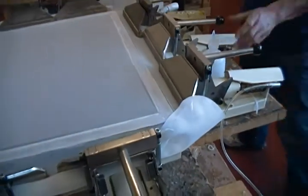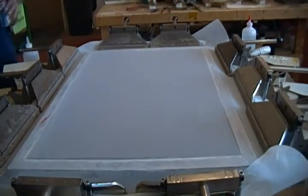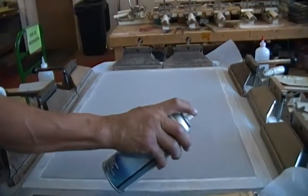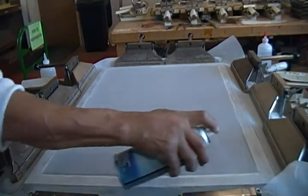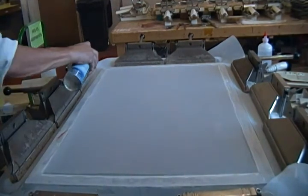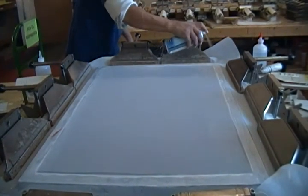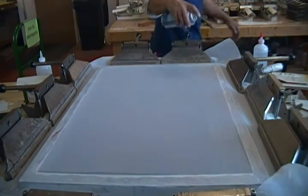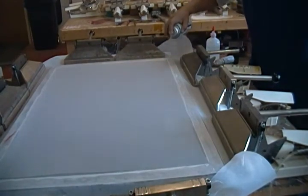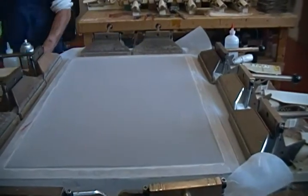At this point the glue has been adhered. What we have to do is harden the glue using an aerosol from SprayAway — all it takes is a touch. We have to make sure that we catch the corners very well. It's an immediate bonding of the adhesive; as soon as the spray hits it, it's bonded. Then we go and hit the fourth side. Done correctly, the adhesive is now bonded to the aluminum.